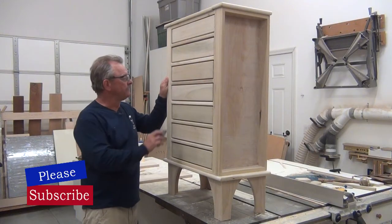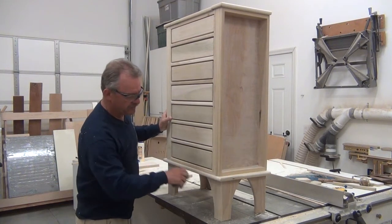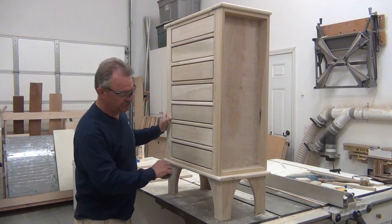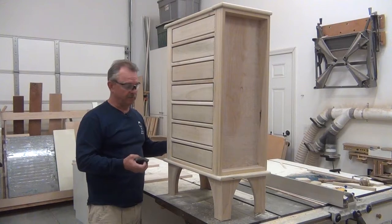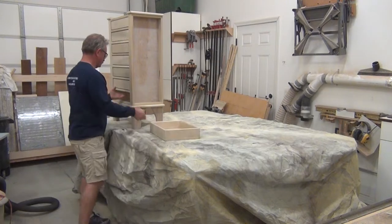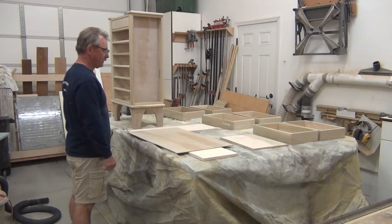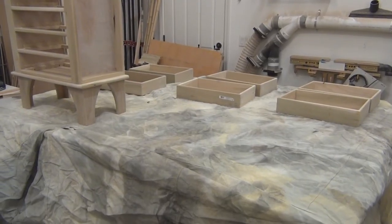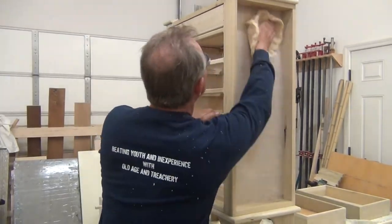To start my projects, I always do a quick hand sand and fill in all my little gaps everywhere. Even the tiniest little gaps — you think they're going to fill in, but when you put primer on them, you're going to have a shadow line and you'll end up filling them in anyhow. It's always about preparation, so I set up a good workspace. Make sure I have room for all my parts after they're painted so they have a place to set and dry. Spray everything off and wipe it with the tack rag.